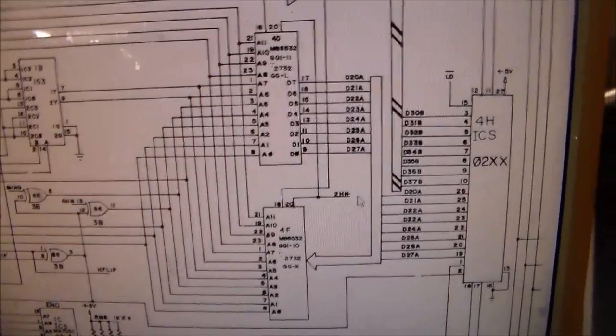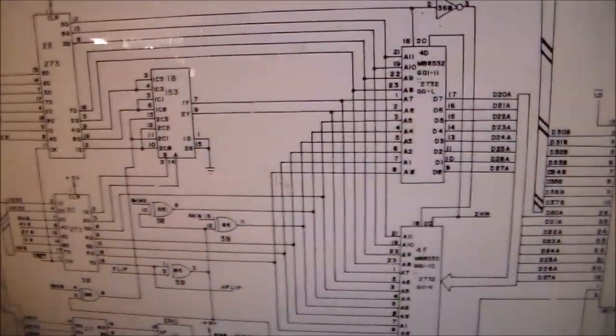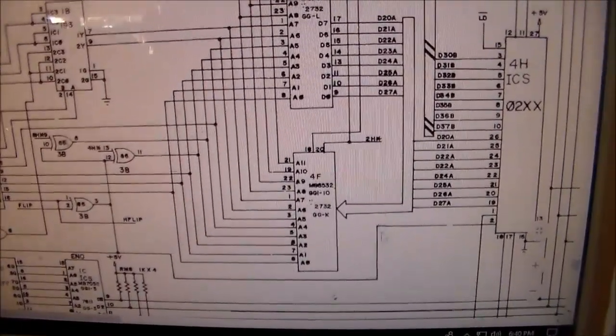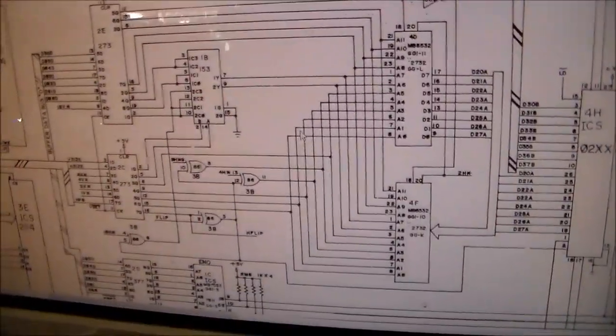So what I'm going to do is take the board back out, replace this socket, and replace the leg on this pin, I mean on this EEPROM, to make it longer, to make sure that it's right. I might have to replace that socket too. And then once we get that done, we're going to try it again and see if that changes anything.